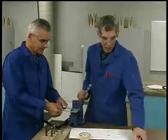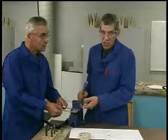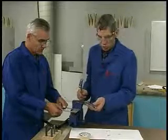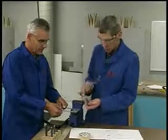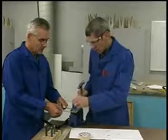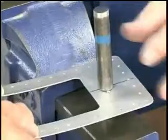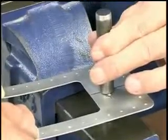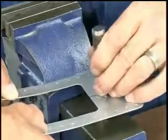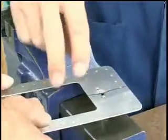So here I've got block number 2 on the vise, and I've got side D up in accordance with the instructions, and I've got myself tool number 2. Tool number 2 has a little ring around it like that. You can see that. My assistant's holding it nice and horizontal, level with the work surface, and I'm going to give it a little bang and a little bang again. It's a little solid. You don't have to hurt it much, just a couple of good raps like that,